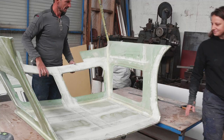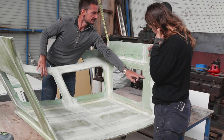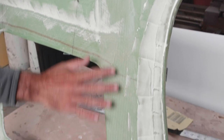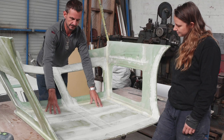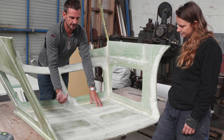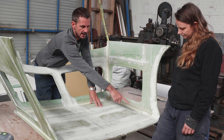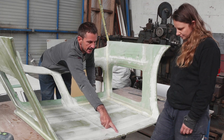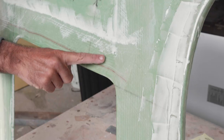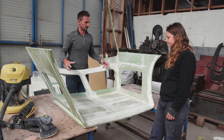And 600 on the inside as well. It weighs nothing. In here we can see that double bias glass — mirrored on the other side. This double bias through here and here is a framework. While we've got a couple of panels of 200 on here and three on the other side, we've got these bands of 400 double bias reinforcing the back section, one through the middle and a couple under the windows. There's just a bit of a matrix all sharing the loads.